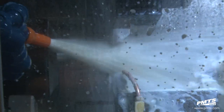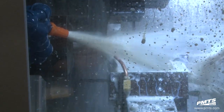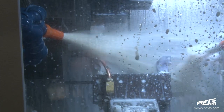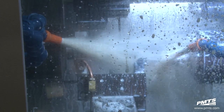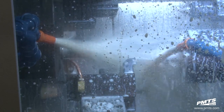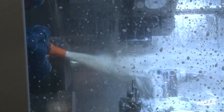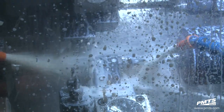Our technology allows for superimposition of the sub spindle on either turret. Right now we're doing it in G540 where the sub spindle is superimposed on a lower turret. It faces the sub while it's roughing on the main. So now the lower turret waits for the main to face, but the sub spindle can continue on in superposition until the face clears.